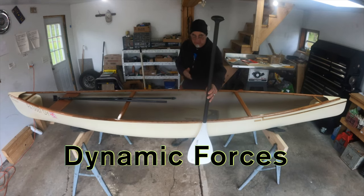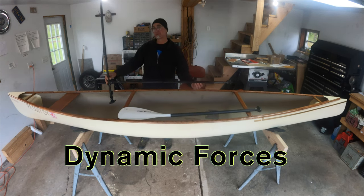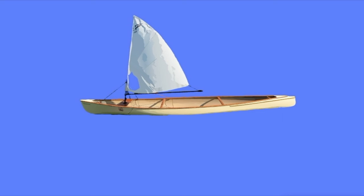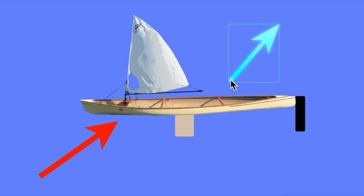I'm not trying to fully explain sail theory, just to give you some idea — something to think about as we go through the rigging. At the end of the day, you're going to have to strive for the balance between two factors: the sail's center of effort and the hull's center of lateral resistance. The sail is affected by the angle of the wind, the speed of the wind, and all those forces focus on the sail to form the center of effort.